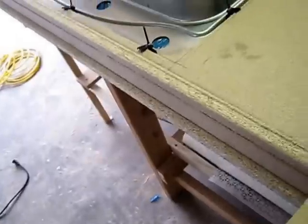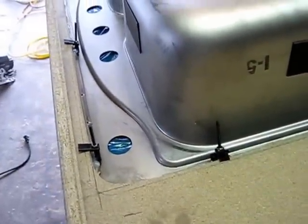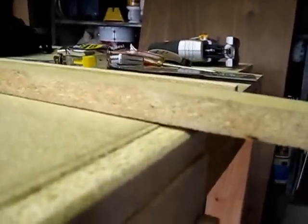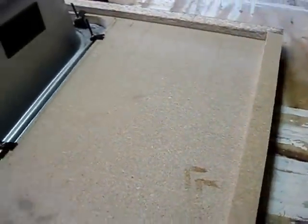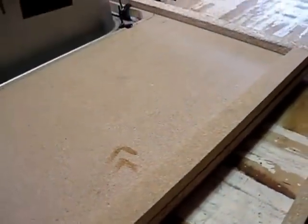Okay, once the sink is cut out, you have to follow your manufacturer's directions and instructions on assembly. This is our countertop, modified for a chimney wall here. And what we're going to do is we're going to add these build-ups. So when you look at this, you'll see this is built up in equal portion to the countertop, and that gives you a raise. So that'll actually give you a profile. Now this will be an end kit, but this will give you a thicker profile, which will average about 1.5 inches. And that's what you'll actually screw your cabinetry right to. So we'll take a look at it when it's done.